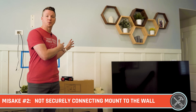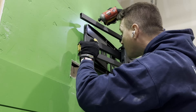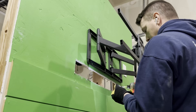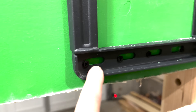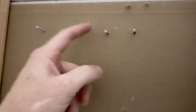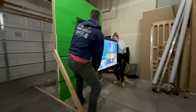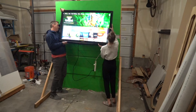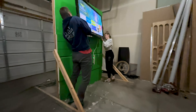The second mistake is improperly securing your TV mount to the wall. Let's take a look at what not to do. On my green demo wall — a full actual wall with all the same components you'd find in any other wall — I've mounted this mount using just drywall screws, none of which are in actual studs. To make it more of a test, I put 16 drywall screws in. This TV mount is rated for 132 pounds, and I'm installing a 50-inch, 73-pound TV. Again, this is what not to do — no studs, no drywall anchors.